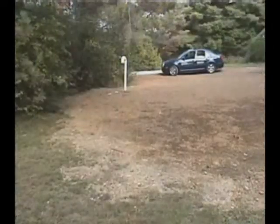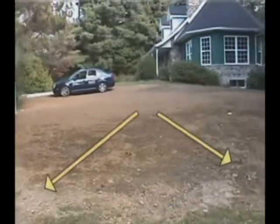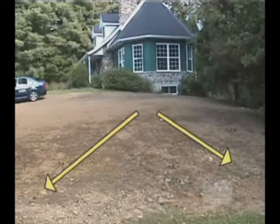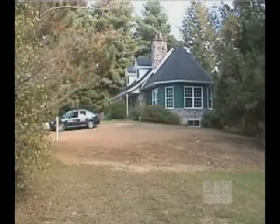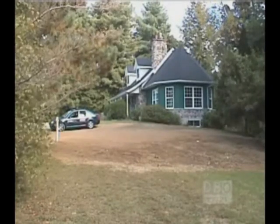When the installation is made partly out of the ground, give the embankment the required slope as indicated in the plan. Plan a light slope on the top of the leach field to allow the rain to flow outward. You are now ready to cover up the installation with herbaceous plants and vegetation. By doing this, you will avoid erosion and minimize water infiltration.